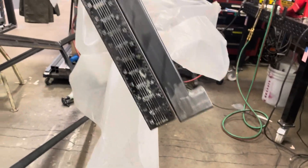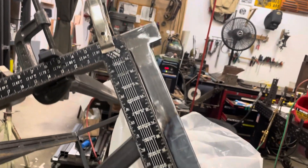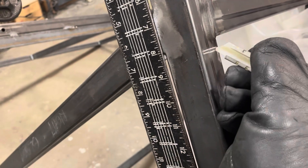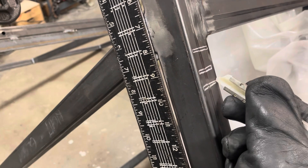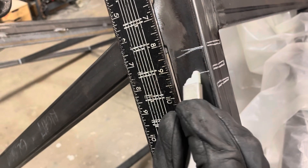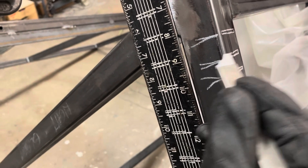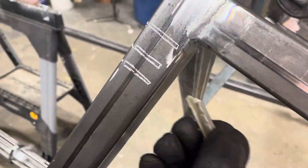Here I'm working on a leg of a table that warped pretty bad when I welded it, and I'm going to try to straighten it up. You can see me lining it up here, and I'm using the usual sort of pattern — mapping it out with my soapstone, heating the back side where I want it to shrink, and putting in some little pies. I kind of drew the pies backwards this time, but you get the idea. Then you want to go over this side and do the same.